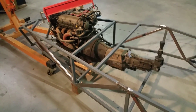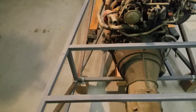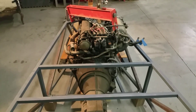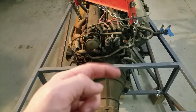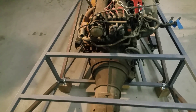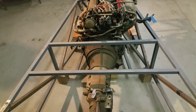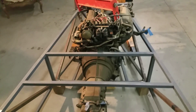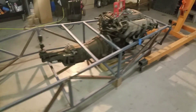The engine I just dropped in there recently, trying to figure out forward and aft where it should go. Side to side is obviously pretty easy — just line up that crank bolt with the middle of the car. I may push it over to the passenger side a little bit because I could use the room over here for pedals, and I don't really care about the passenger's feet all that much. I think I'm going to notch out there and make a little X brace here so the engine can sit back a few more inches. I also don't really want to build the extension for the shifter, so I think it'll go back a couple more inches.